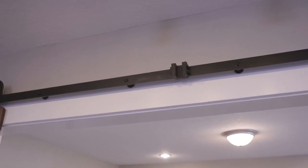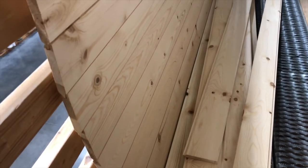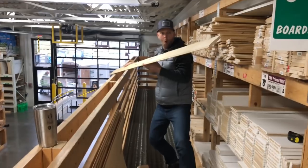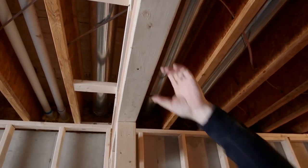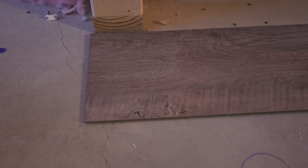Once you've worked out how to support your doors, make sure you get really good measurements. With those measurements you'll be able to determine how long the boards need to be and how many to put together to make the door the correct width. We're going to overlap an inch or two at the top and leave about three-quarters of an inch at the very bottom so it doesn't rub on the floor covering.